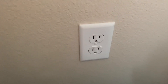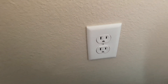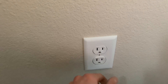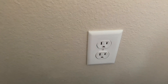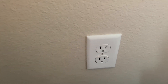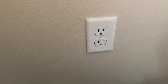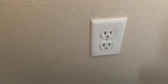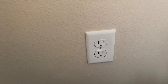If you're new to electrical work and worried about doing things wrong, after wiring you go through with a plug tester and check all the outlets. If you wired it backwards it'll tell you, and you just take it apart and change it. The rule is simple: ground to the green screw, white wire to the silver screws, black wire to the gold screws. Everything gets checked before the end of the project, so it's not as scary as it sounds. Hopefully this helps — catch you guys next time!